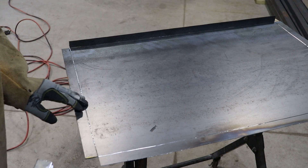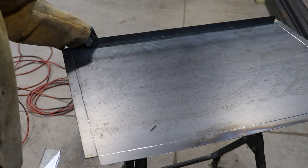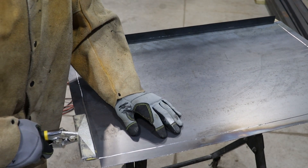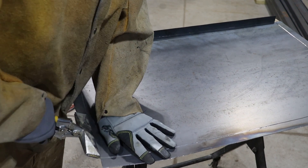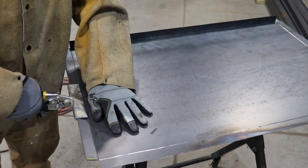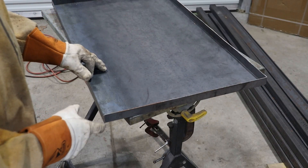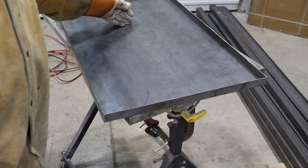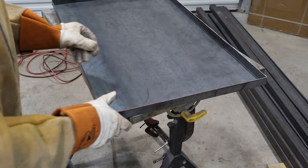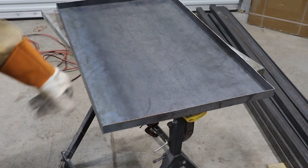This is a little bit difficult to bend, but I've seen guys make some really deep grooves in here and almost take away all the strength. So I just scored the line and tried to put a lot of effort into bending these to make sure I have plenty of metal on the other side. I'm going to get these corners welded up and then look for some angle iron to put in the middle here — it's still kind of flimsy, so the angle iron right there in the middle will give it a little bit of strength.